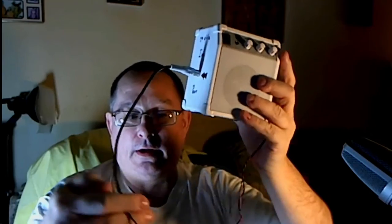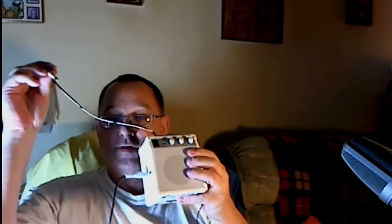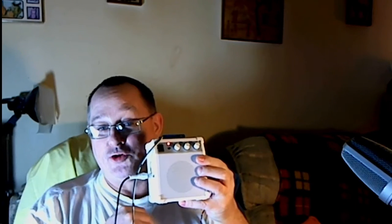And here is the input. This plugs in like this with a little RCA and then that splits off into a couple of test probes. On the top we have the star of the show — our little 9-volt battery with some test leads. So when I'm done with a circuit board, a guitar effect PCB, you connect the output of the beep to the input of the circuit. This goes to the output of your circuit. Then the power supply is this battery here — you clip that onto the power wires.